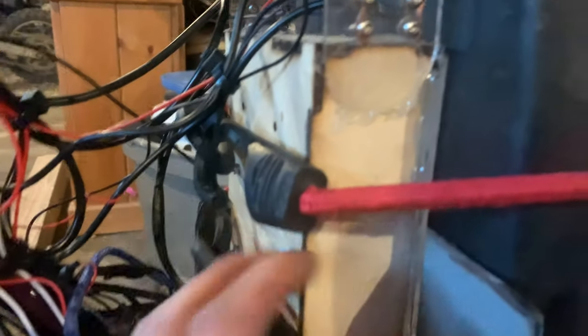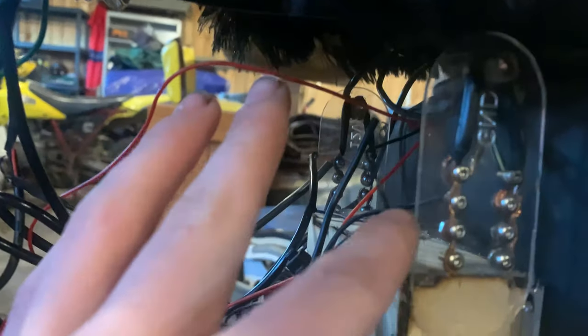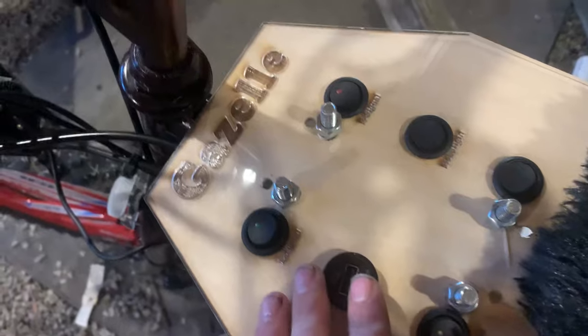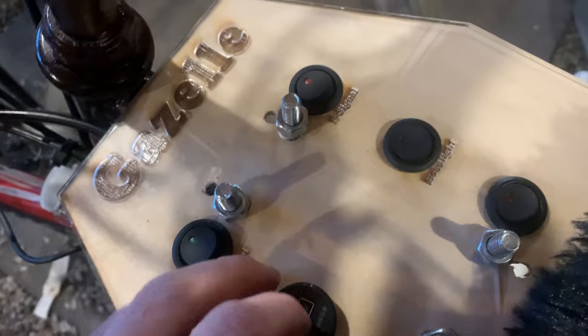As for the bike's electronics, there's a laser cut wood box up here which contains an Arduino and a four channel relay module, which interacts with bus bars for 12 volt and the ground — shared between the 12 volt converter and the electrical ground, negative, coming out of the battery. Up here you have the dashboard, which I engraved with all the button labels.